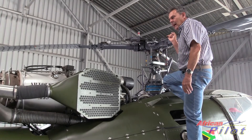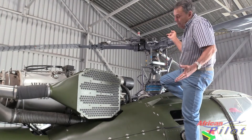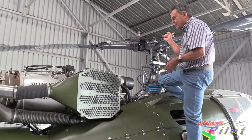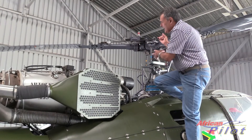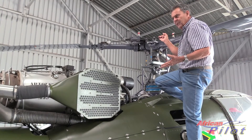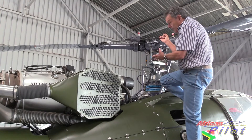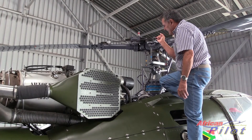The French designed this stepladder effect so that the engineer or pilot could gain access to the main gearbox, mast and rotor head. The helicopter was very maintenance-hungry and needed to be maintained on a regular basis. In fact, every five hours the system has to be greased - each pivot point on the articulated head has a grease nipple that has to be cleaned and greased. So if they were out in the bush doing five hours a day, the helicopter had to be lubricated at least once a day. This also allowed inspection of all the linkages, bell cranks and control linkages, as well as the clutch.